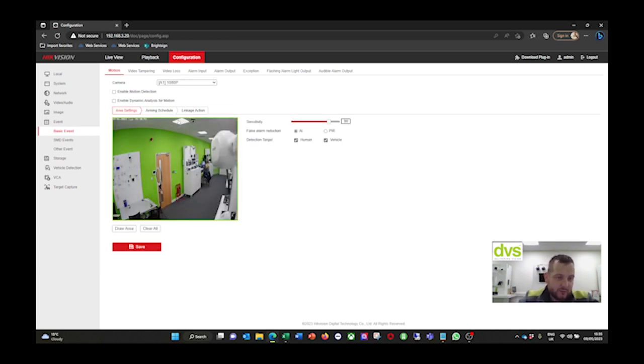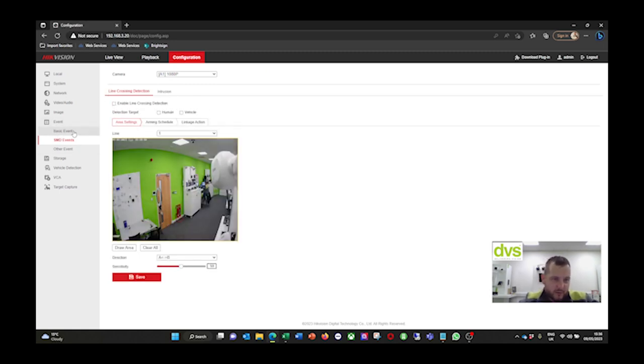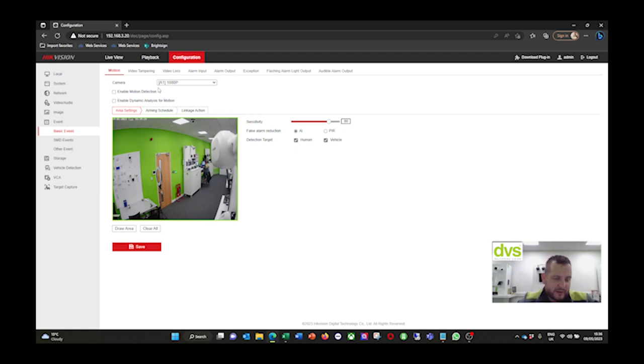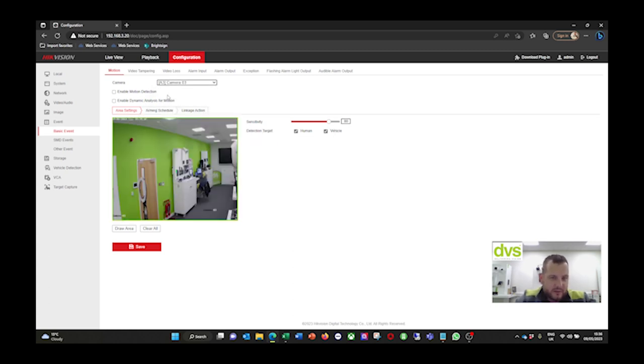Under Event, because it's got built-in smart motion analytics, you can use smart motion - enabling motion detection for human or vehicle false-alarm analysis. You can use that with motion detection, or with line crossing or intrusion, depending on what's best for your client and installation environment. I tend to put it on constant record because I don't like to miss anything. I've turned all motion record off on all cameras and I'm going to use the smart event for the alarm notification trigger.